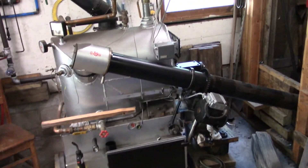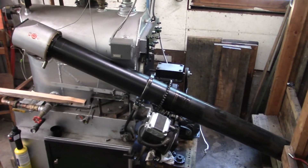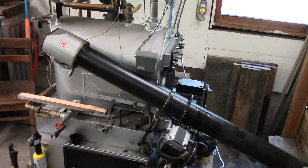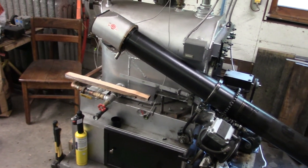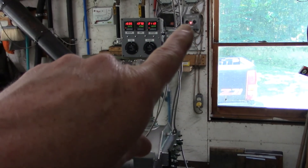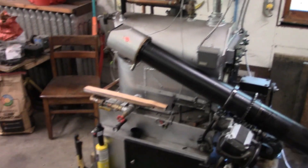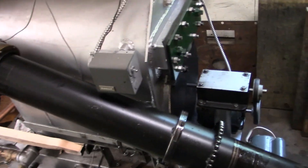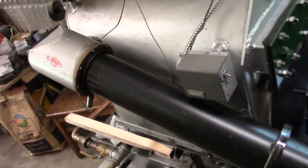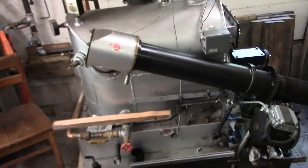We've changed the settings a lot — I have it running three teeth right now. I tried a three-inch fan pulley to bring it up to 1725 RPMs on the fan, just so it would recover from sitting for so long. That didn't work, so now the timer is running one minute every 30 minutes. We still had out fires, so yesterday we put the four-inch pulley on the motor — now we're overdriving the fan, probably around 2200 to 2300 RPMs.